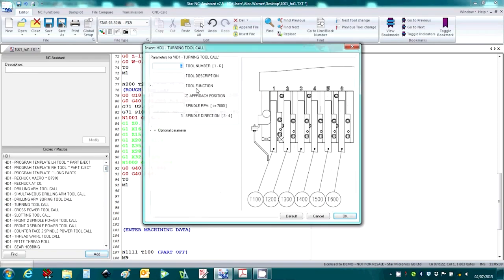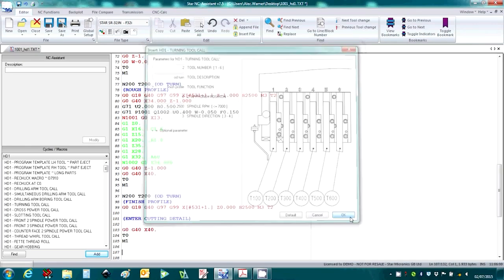There are many sliding head brands in the UK and worldwide. Star have their NC Assist software — a template-driven piece of software that helps you create programs quickly. Fanuc, Mitsubishi, Siemens controls are all available, and offline options include Alcart Wizard with Citizen and NC Assist with Star. These programs aren't just about making programming easier — they're about optimizing the program too: reducing idle time, keeping tools in cut, balance machining. Software elements are really important not just to simplify but to make the machine more efficient. Vericut is also used by some customers to prove out programs from the office before running.